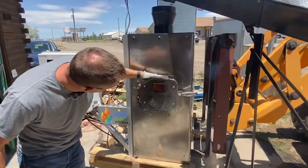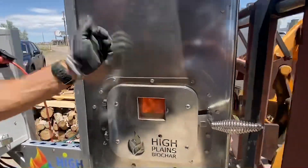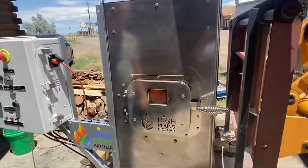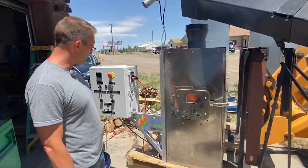As you can see, we've got a nice hot fire going in here. Our set temperature is at 1400 degrees, and right now we are at 1391. We're fluctuating around 25 degrees plus or minus as the fuel turns on and off.